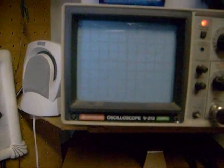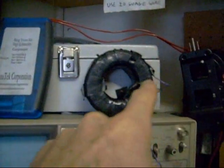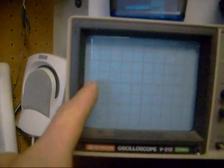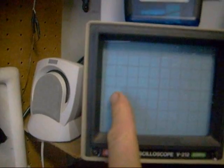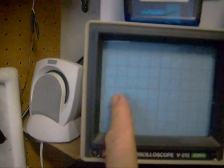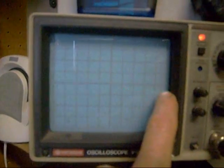I don't want to confuse you with too much technical detail, but this is actually showing what my ring tester is doing. It sends pulses of energy into the coil — this one line here represents one pulse. Any time you disconnect the power after sending one pulse of energy into a coil, it doesn't just go away instantly. It tends to oscillate and then dies down, as you can see here.